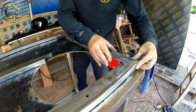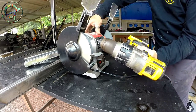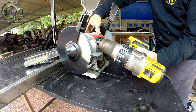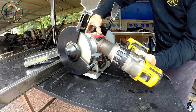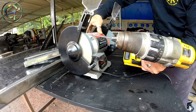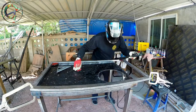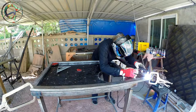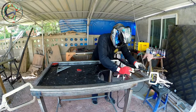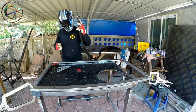Before doing that, I have to deal with my electrodes. I sharpen my electrodes with an electric drill and a dedicated bench grinder armed with stones that I use only for TIG electrodes — to avoid possible tungsten contamination. And here I am ready to weld, working with a WP-17 torch armed with a 2.4mm thoriated red color electrode, stubby gas lens, and an argon flow of 7.0 liters per minute.